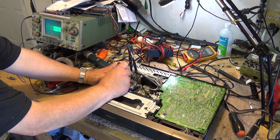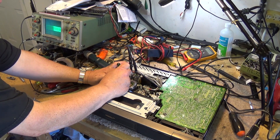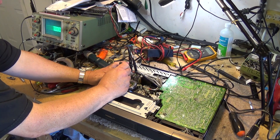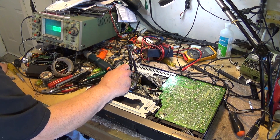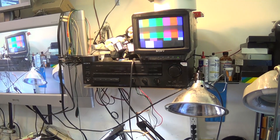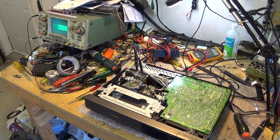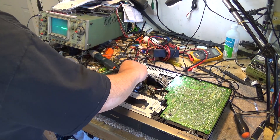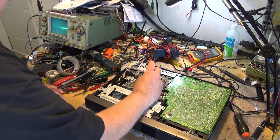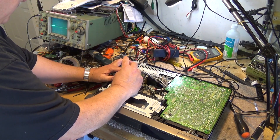Wrong way. Pretty close. That is pretty darn good — airplane flying over of course — there's our playback complete with the dropouts on the tape. That's tape path alignment using a scope. You can do this without a scope too. I can disconnect the scope, mess with the guides, and make the picture all screwed up — I'll mess with both guides just to mess up the picture big time.